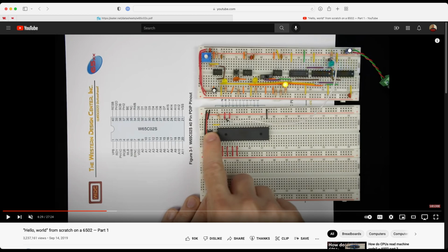At this moment, what you see on the screen wouldn't work because the power and the ground here are not tied to the rest of the circuit. So what are we going to need to add, either right here or over there on that side? It doesn't matter. We just have to tie it: positive to positive and negative to negative, so that the clock circuit's power and ground are common with the computer side's power and ground. In what's on the screen at this moment, they're not tied together. The clock is going to function because it's the one plugged in, but the computer wouldn't because it doesn't have power.